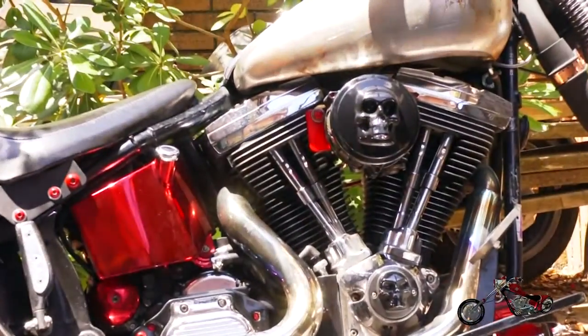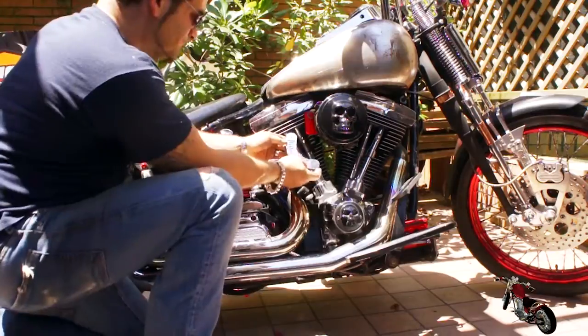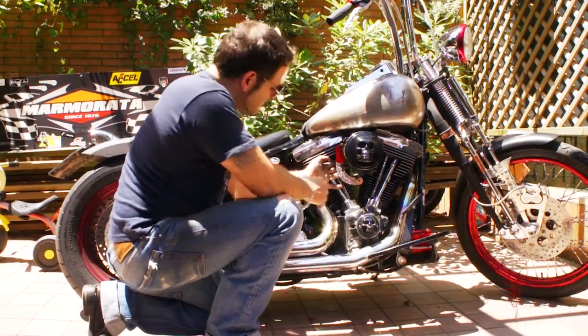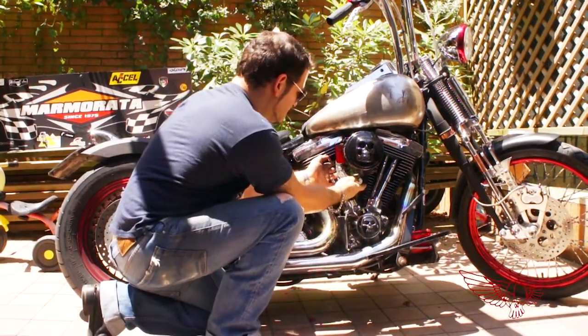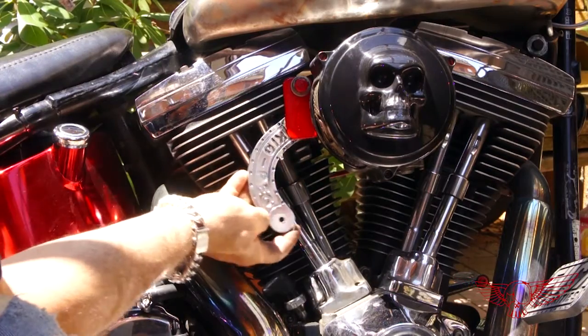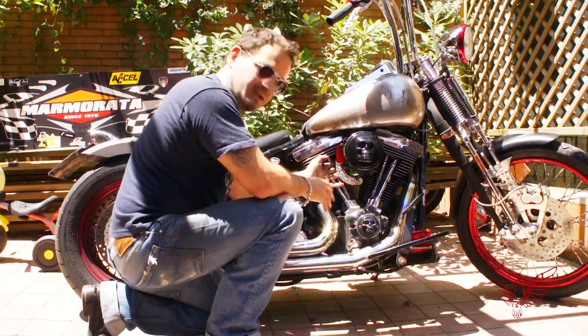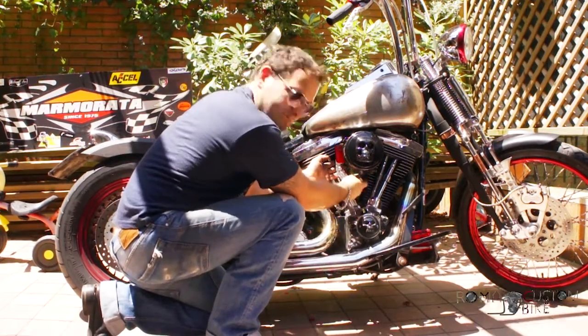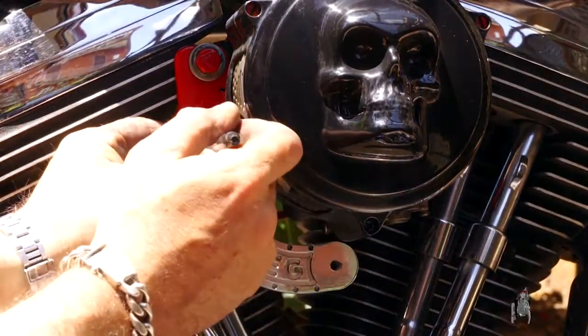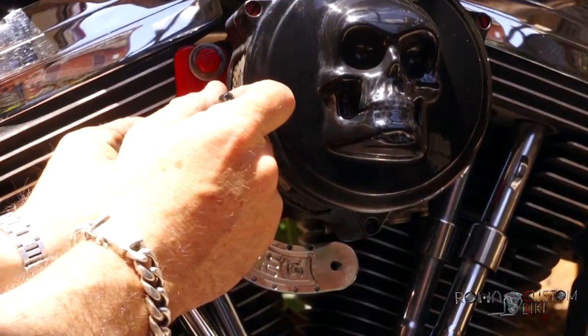It's now time to see the piece on the bike, and I'm hoping I'm on the right track. Our support is going to pivot onto a hole in the air filter support, and now we have to proceed with making the actual peg. I have to confess that this time I got lazy and decided to make the passing hole directly on the bike without taking the air filter support off, but I do suggest you be a little more proactive and do it properly.